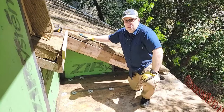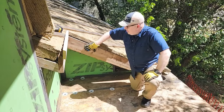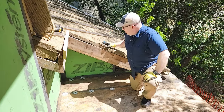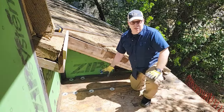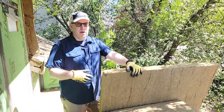We've got all the roof insulation on — you can see two inches here, and we have another eight inches below this two inches. We have this blocking here which gives us something to nail the soffit and fascia onto, and we also have the furring strips. The reason we weren't able to pack this out yet is because we didn't have the insulation down on this deck. So we're going to put the three inches down on the deck, then put eight inches in the wall.